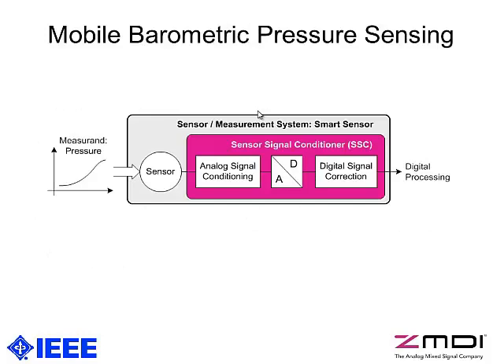What I'm going to present is mainly this central signal conditioning area, consisting of some analog pre-processing of the output of an external sensor element — typically amplification and filtering and so on — A-to-D conversion, and then digital signal correction. Overall this is called a smart sensor system, and in the presented case example we are measuring ambient pressure plus temperature and provide a digitally corrected output.